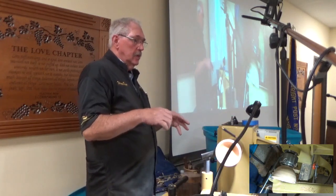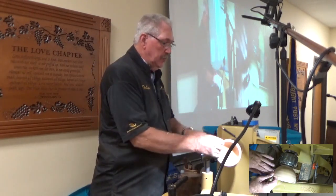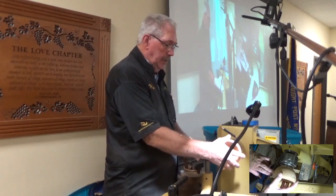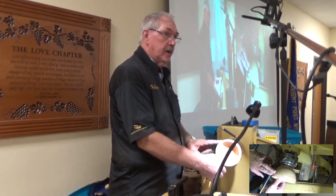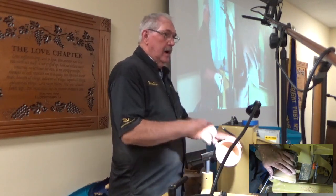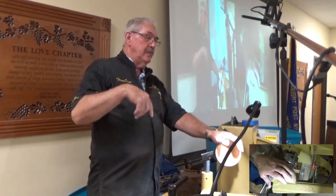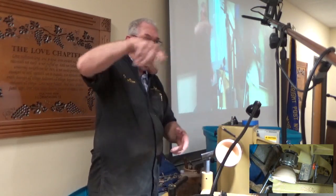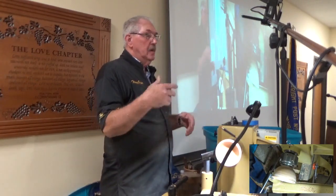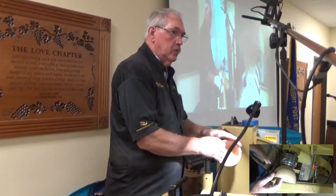Yeah, because segmented wood, you've got a lot of end grain. On this piece, the wood's going this way. When my tool's cutting here, I'm cutting with the grain. Here, I'm cutting end to end grain. On the segmented turning, depending on how many pieces are in there, I can be cutting end to end grain 48 times on each revolution. So you get a lot more tear out. So what he's talking about, seal it up real good with shellac.